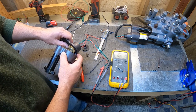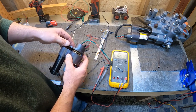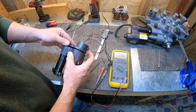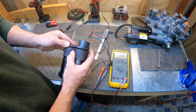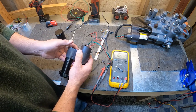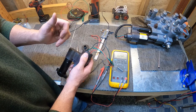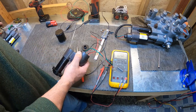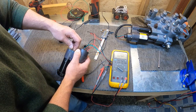And this one's a little more difficult to get lined up than the first generation. So that's perfect, 2 volts. Carefully. We've got a gasket in here. I've got the gasket taken off, but we'd line up the gasket, carefully try to get the head of this actuator back down. Oh man, so that maintained 2 volts. I don't always hit it first time. Sometimes I have to take it on and off, move that gear just a little bit in either direction to hold that 2 volts. But man, nailed it first time. Cool. Then we just put some screws in it to put the top back together.